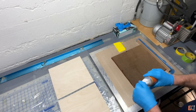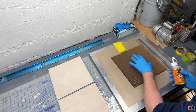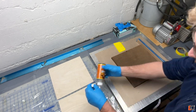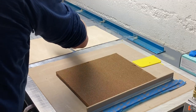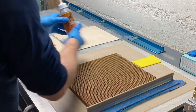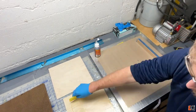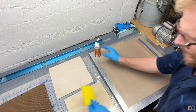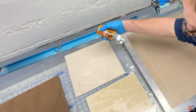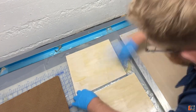The adhesive I'm using here to glue this birch ply is Gorilla Glue, which is a woodworking polyurethane glue. I'm applying what will turn out to be not quite enough of it onto the plywood, and working it in with a squeegee. I wanted to see how it works — it's significantly lighter and it foams up in contact with water.